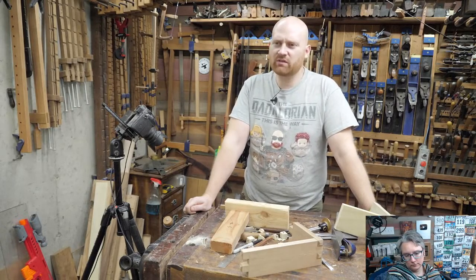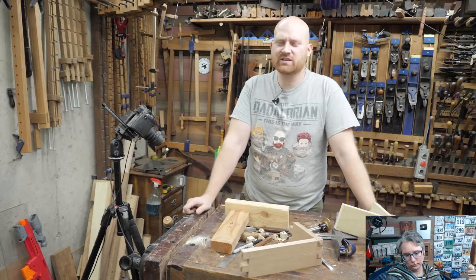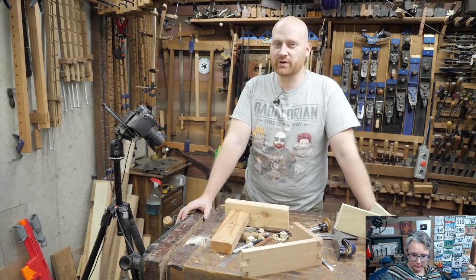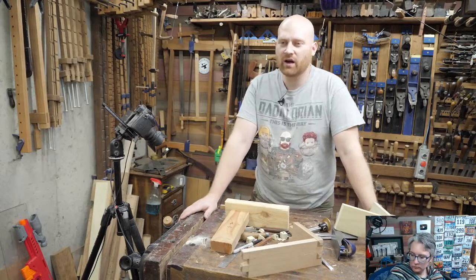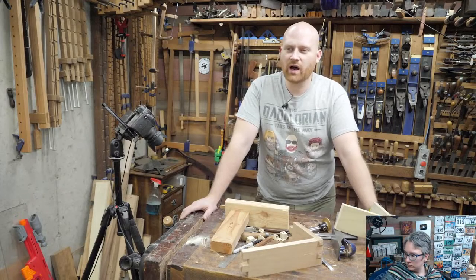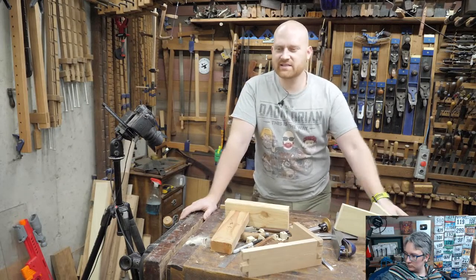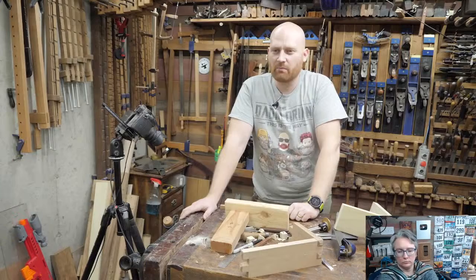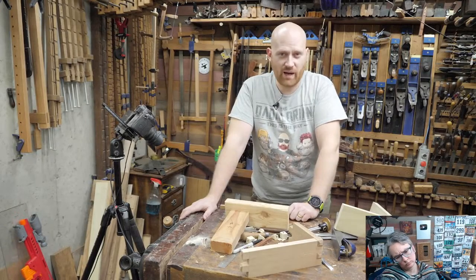I generally don't veneer MDF. I don't like using any MDF in any project. I've just had bad experiences with it, even for something like a keepsake box. I would prefer to veneer a manufactured plywood, or a stable piece of wood, and try and make the veneers go with it. Or have a thin piece of wood that doesn't move so much. I try to stay away from framing a solid board with expansion and contraction problems. Probably the one I use the most is a rabbeted top.